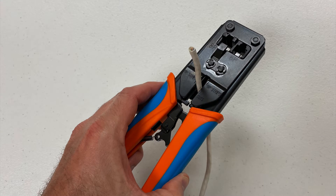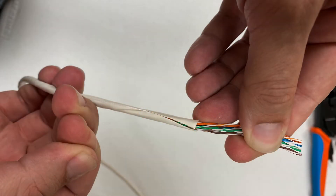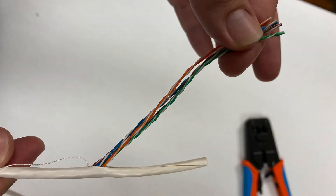Next, you'll need to strip the outer layer of your network cable. You can use the standard electrical snips or the cutter built into our RJ45 crimping tool. Almost always you'll score the underlying twisted pair cable — it's really difficult to strip that outer shielding without slightly cutting the inner cable. You could use the drawstring to peel back that outer shielding a little bit more.